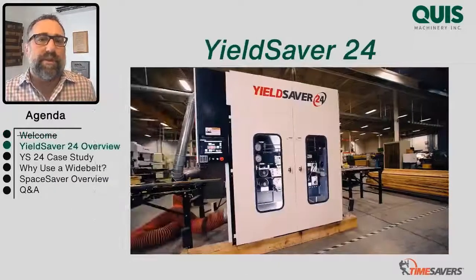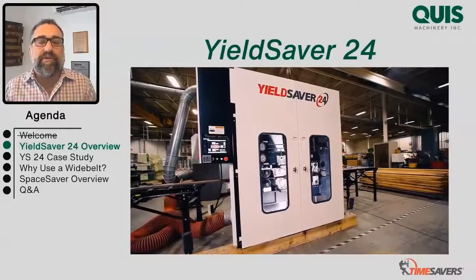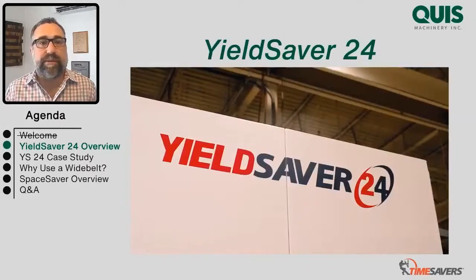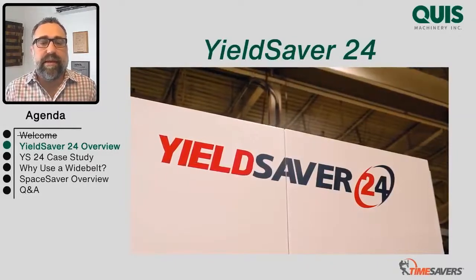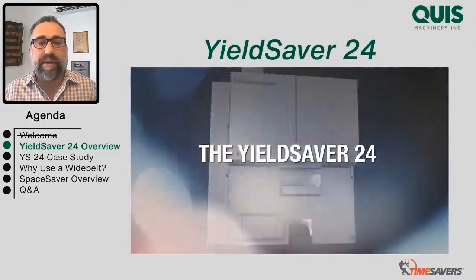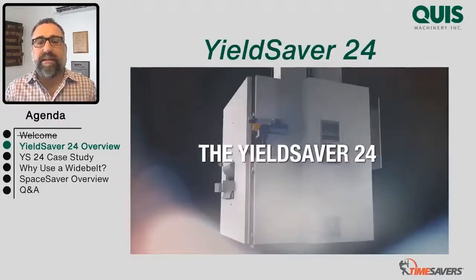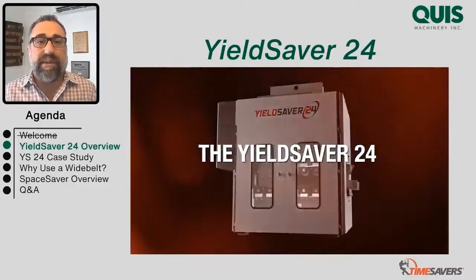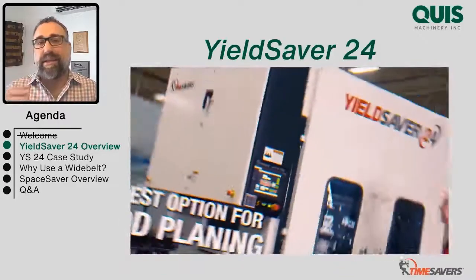So first, as I mentioned, we're going to talk about the Yieldsaver 24. Timesavers builds this machine in Minnesota at their factory right up there in Maple Grove, so it's a great American-made machine. It's a top and bottom planer. And what really makes this machine different, and really advanced technology, is floating heads.